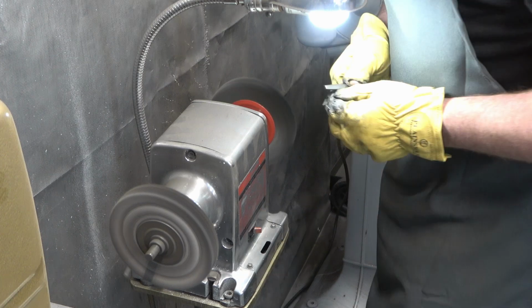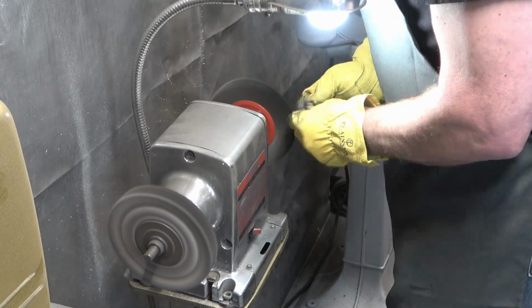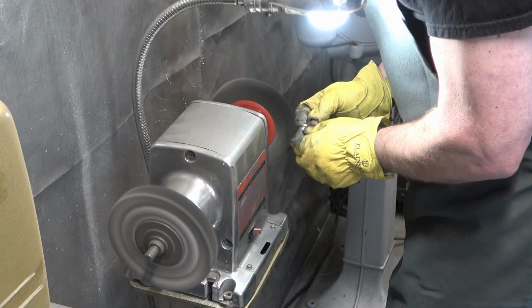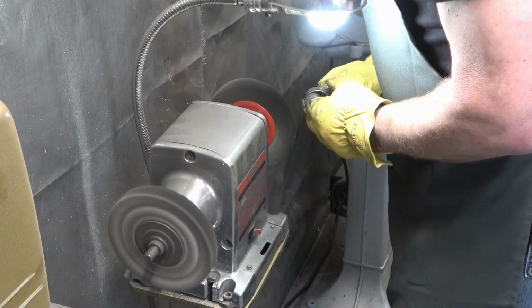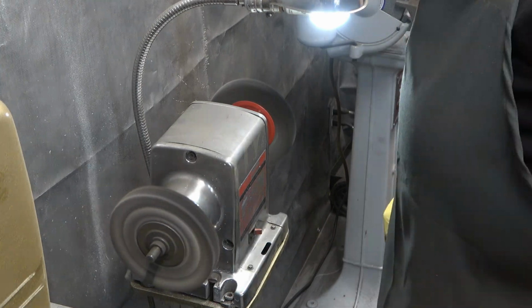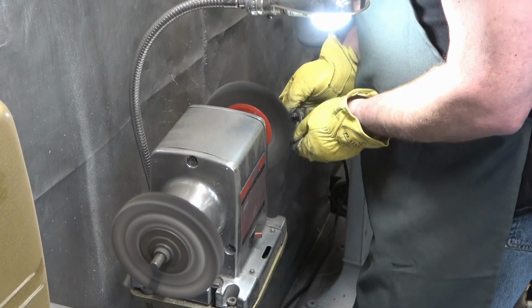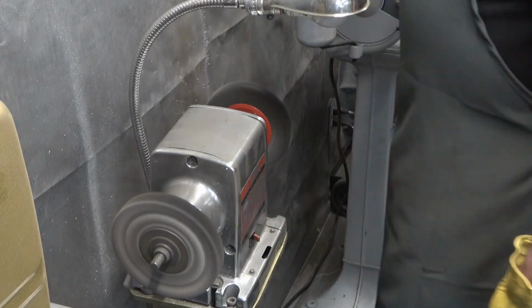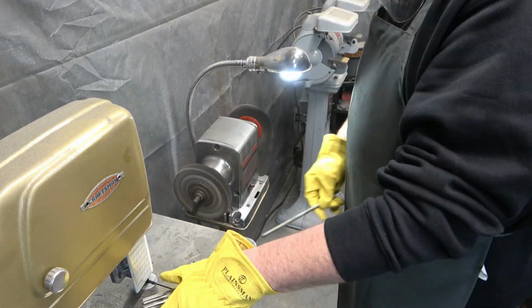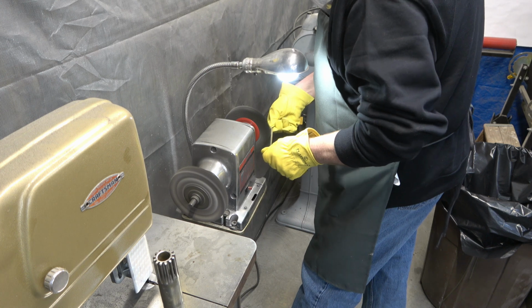And these are the jaws for the chuck. And I think, yep, we're cleaning the split nut or half nut for the chuck as well. I think that's the wire retention bracket that goes on the side of the head, which is erroneously called the capacitor clip or something like that. This is the pinion. We're just going to clean up the splines on the pinion. And then this is the tension rod for the motor mount.